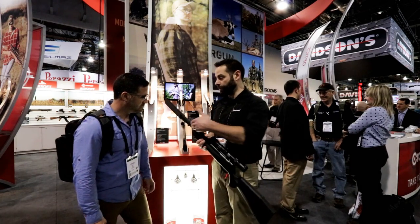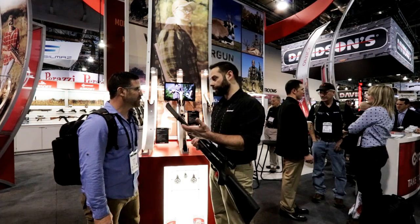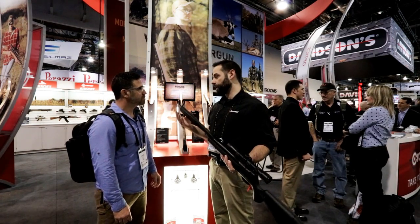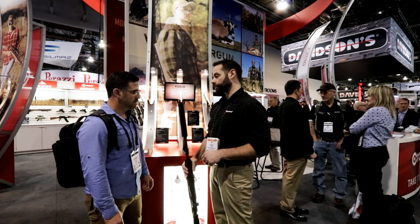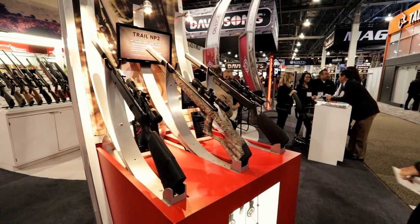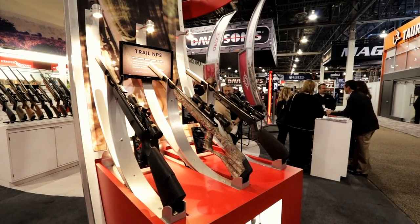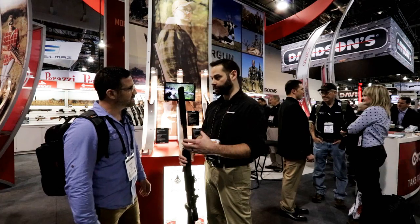The aesthetic here is a little different than your conventional silencer, where you just have an oversized tube at the end of the barrel. What we're doing here is an asymmetric or eccentric design. You'll notice the bore is not centered with the silencer — it drops down below. The idea is: how do we maximize the volume to allow gases to expand and attenuate as much sound as possible, without growing concentrically and occluding our sight picture — without destroying that line of sight.